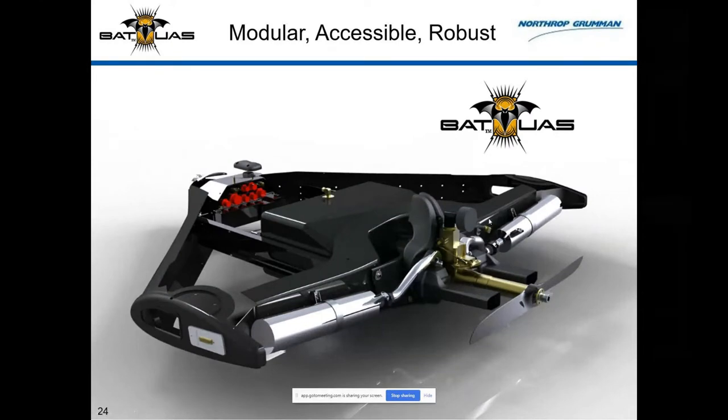But let me show you something here with this airplane. Here's the front spar. See those holes? The front spar was mounted with all these nut plates up and down so that we could change our idea on where we put mounting rails. So this mounting rail mounted to nut plates here and nut plates here, and we could take it out and make a wider tank and have it on rails that went here to here. So I mention this just again for everyone to think about when you design this airplane, how can we make it as useful to the end user as possible, accessible and flexible, so they can change their idea about things later on. Some things ought to probably stay put.